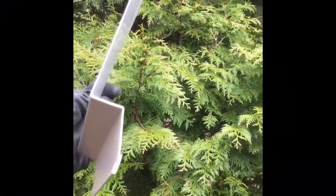Here comes the moment of truth. It's a profile that we bent up. Safety hem on the bottom. Actually, I already had to trim off the top. That was a 1 inch return, and I cut it down to about a 1/2 inch. So slide it under the drip. So that looks pretty good. Just enough clearance under there. Just gonna screw the bottom. It's gonna sit in there super tight and cover this bottom gap. And that looks good to me.